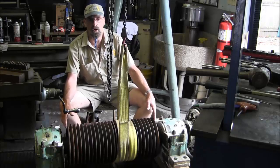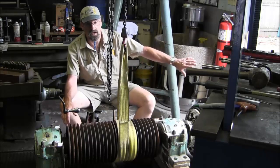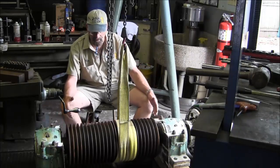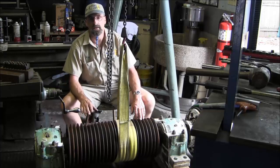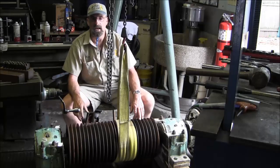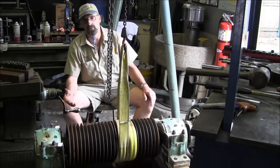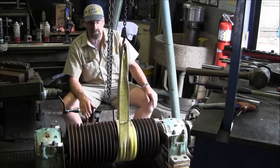This is a jack shaft off of a large pulverizing machine for the company Robert R. There's a giant diesel that drives on this end. There's a V-belt section here on the shaft that transmits a belt drive down to another set of pulleys, and that set of pulleys runs another shaft over to a drum and a giant hammer. They put in giant tree stumps and it pulverizes them down into small pieces of material that's shipped up north — processed out to be press board and imitation beams and all that kind of stuff in new wave construction.